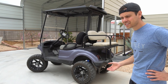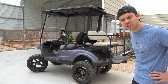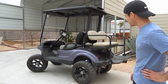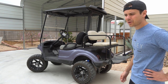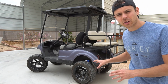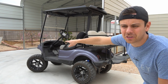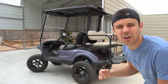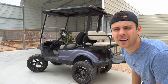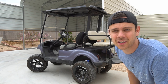All I need now is airless tires and this will be the perfect vehicle. There's no oil to change, I can work on it myself, it goes 47 miles on a single charge and can go off road. During summer I won't leave it out in the sun though, because it will cook the batteries — it gets like 120 degrees out here in the desert. I'll keep it under the livestock shade and run wires to the solar panel array. That's really the only downside of a roof-mounted solar panel on a golf cart in the desert. For the other nine months of the year I can leave it outside no problem.